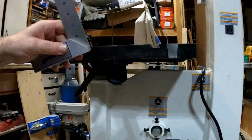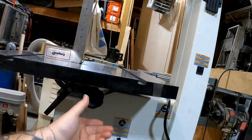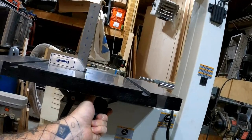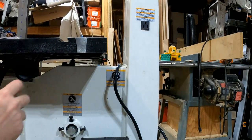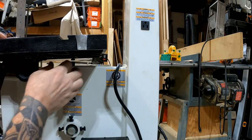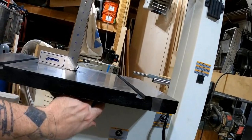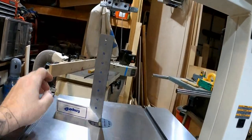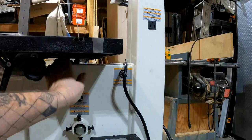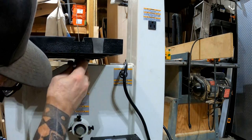And then we have to take a square, put a square up here on the blade, and get that set to where that comes in really square. So I'm too deep with the bolt already, so that's got to go back up in there. Ooh, that looks pretty close. And that is it. So now I can reach up in there with a wrench and tighten up the upper nut on that.